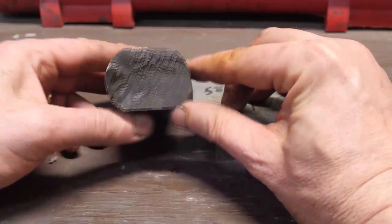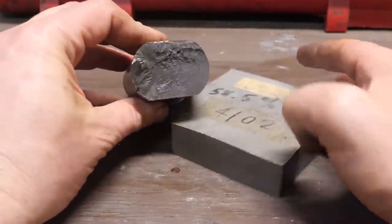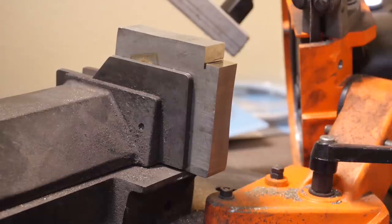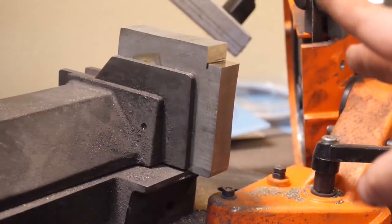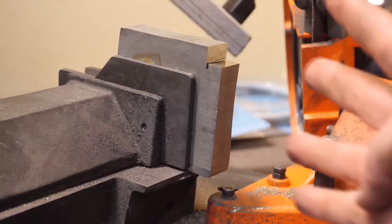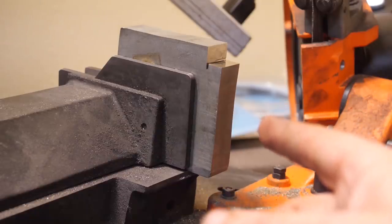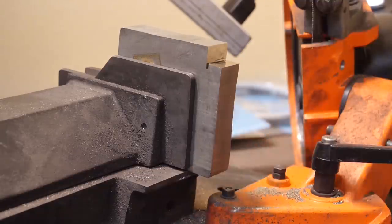I have not found anyone who has tried to forge this stuff, and according to Rick, these specimens are flat-out original gangsters. I'll need to cut off a few small pieces to test their properties before committing to a piece large enough to actually make a knife out of. I'm sort of in over my head, and I have some predictions. Number one: it's going to take three times as many saw blades as normal. Number two: three times as much grit. Number three: I'm not going to be able to heat treat it correctly — I'm going to send it off to have it professionally heat treated. Number four: something's going to catch on fire or explode. Number five: I'm going to have to forge it in a can to keep it from oxidizing. Number six: this isn't going to work.